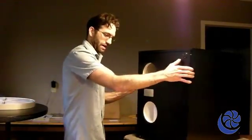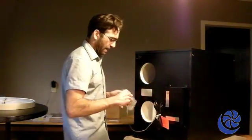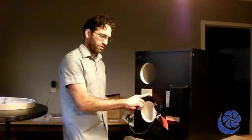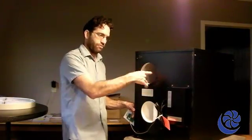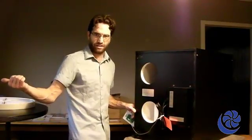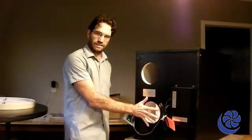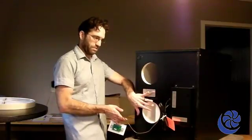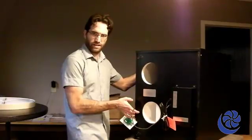So let's look at the other side for a moment. The opposite side of the unit also has the same 2 ducts, this one denoted as taking, both of these being connected to the outside. So this duct takes air from the outside, and this duct takes the air from the house and expels it to the outside. So both of these ducts get connected to the outside. So we know what we're doing with these. Both of these get connected to the outside from the unit, insulated ductwork.